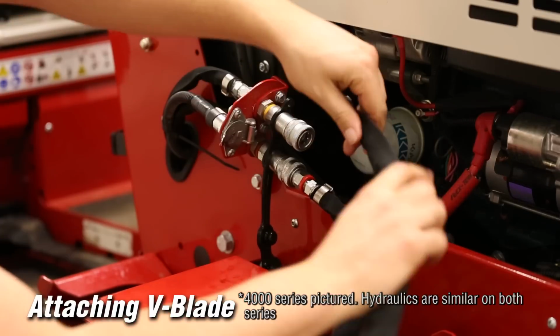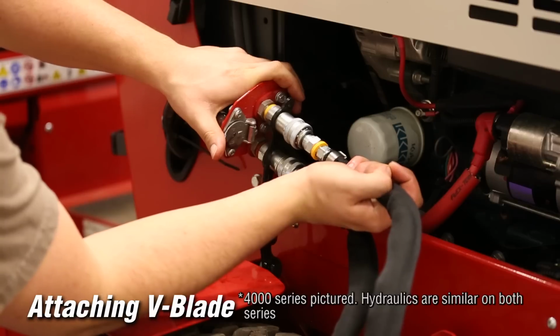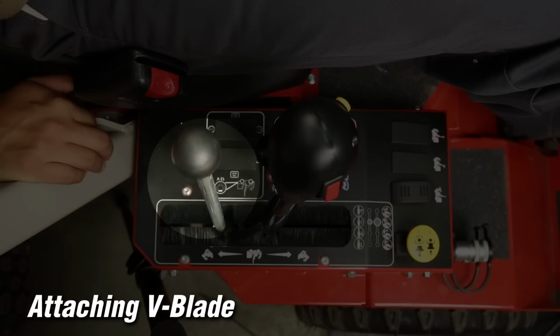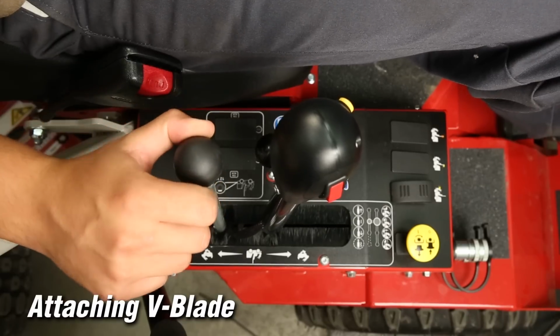Pressure buildup in the attachment hose and the power unit couplers may occur, causing difficult installation of hoses. If hoses do not easily connect, try one of the following steps. While the engine is still turned off, move the secondary lever of the SDLA right and left to release pressure in the power unit's hydraulic circuit.